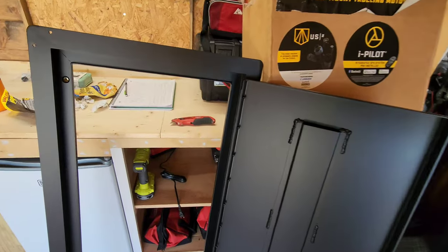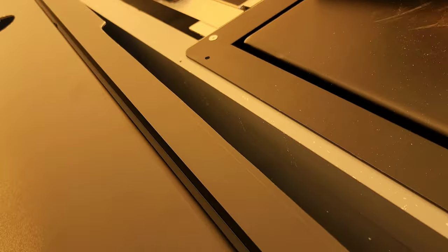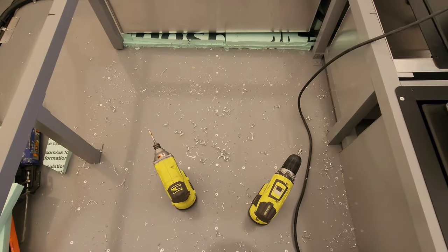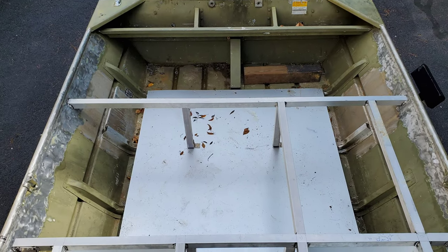You can see here the welded hat channel underneath the 4-foot rod locker lids, ensuring there's no flex. I had to notch the lid track lip to get a flush fit with the center lids overlapping the framing. I bounced to the cockpit to properly rivet down the floor, something Cary and his cousins had forgotten about. From there, it was time to complete some framing in the back of the boat as the framing was left unfinished upon arrival.